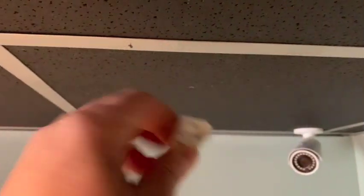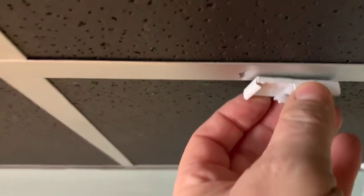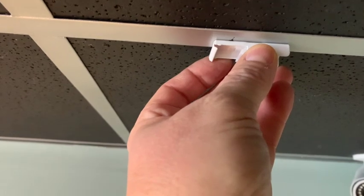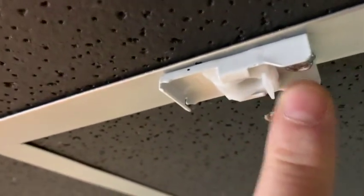I put a mark here. I know I want to be two feet from the wall — two feet out. What I'm gonna do is have the track right at the two-foot mark. I'm probably gonna go halfway, mark my holes, drill, and mount these brackets. I've mounted these brackets here with some self-tapping metal screws. I'm gonna do all the way down and then we're gonna mount our track.